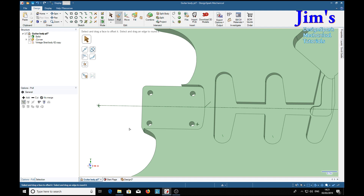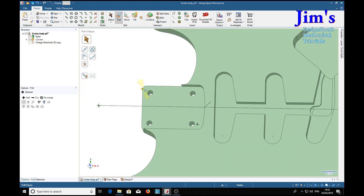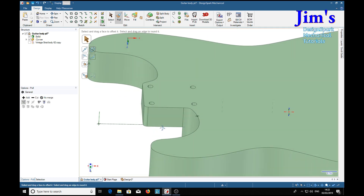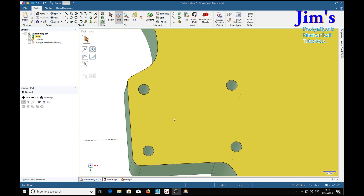The hole is 0.166 diameter for those four holes — but it's in a quarter-diameter countersink at 82 degrees. Obviously that's important for the fitting. I'm going to put this 82-degree chamfer or countersink in just to demonstrate one of the DSM tools. That's on the far side, so we turn the whole thing over. This may seem to be doing things backwards, but we've started with the diameter of the countersink, which was quarter diameter, and now we're going to put our countersink in at 82 degrees.